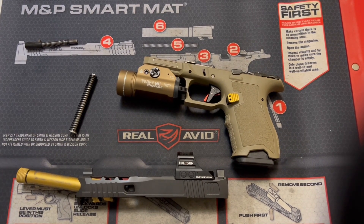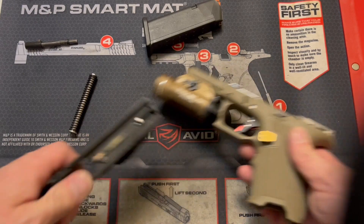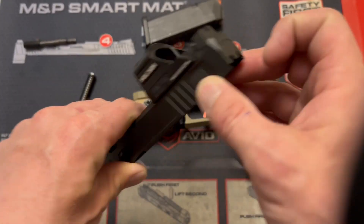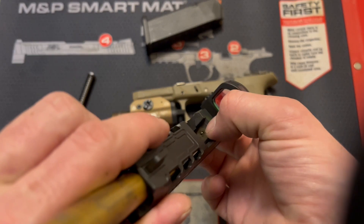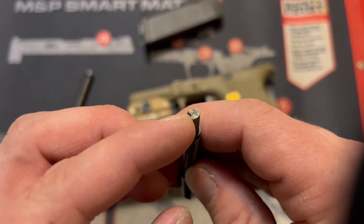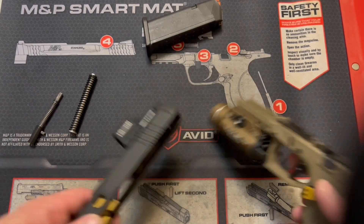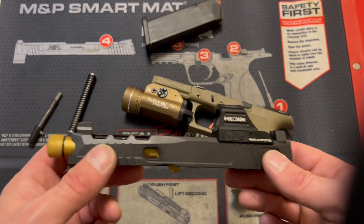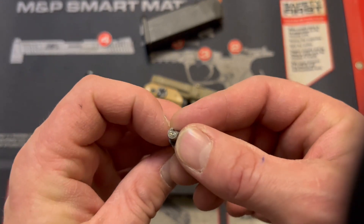Here we have the firearm semi-disassembled. On a Glock or Glock clone, this back plate slides out and your striker assembly is inside there. If you can see in the breech face, that little piece of metal — that is what's missing from here. And if you look closely, it literally just sheared right off. This is after only a few hundred rounds. I have not beat this gun up, I've not torture tested it or anything like that. I've shot it maybe five or six hundred rounds so far — not enough rounds for a striker to break, in my opinion. Literally the firing pin is broken right off of it.